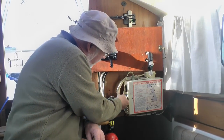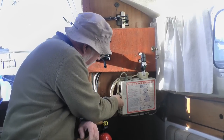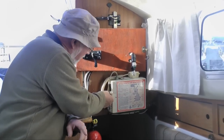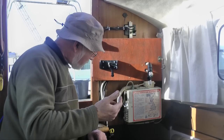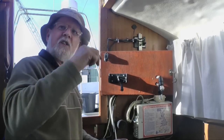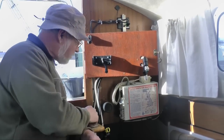Okay so we want channel 86. I don't know why you've got 86 on here — it's 20. No, you haven't got 20. Oh, that's a bit of a bummer. Well, so I won't be able to pick up the weather forecasts. Yeah, but not on that particular aerial. Channel 23 is the one at the Needles but it's also the one for Portsmouth. The aerial — well that's good, so that's just working from the little bit that's sticking out by the mast. They will pick the signal up but you don't want to transmit because you'll blow it if you don't. Well, that's another problem solved.